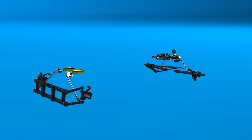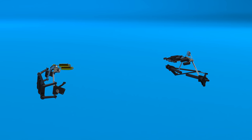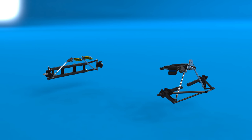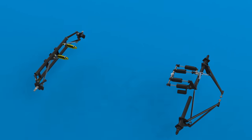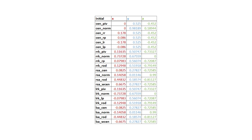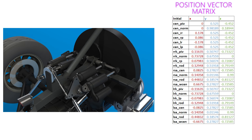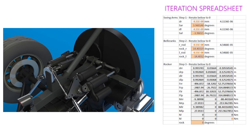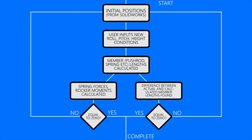With all of that in place, now we need to look at the actual vehicle dynamics. There wasn't any tyre data available for the Hoosier tyres that we run, which meant that I couldn't delve too deeply into looking at the car's handling characteristics. I stuck therefore to a few simpler methods that could be used without that tyre data. Since the front was pretty much fixed, I was focused totally on getting the rear to work well with the front. To do this, I built a spreadsheet in Excel that would allow me to input all of the points describing the car physically — pivot points, suspension mounts, wheel centres, that sort of thing. I added in functionality that allowed each of the pivoting points to be moved. As the length of the joining members was known, I could check the resulting length of each member after a rotating pivoting point was moved, compare the difference, and determine a new angle for the pivot. In this way I was able to run through a number of steps within the spreadsheet, eventually finding the new positions iteratively, mostly relying on vector algebra to handle movement and rotation in three dimensions.